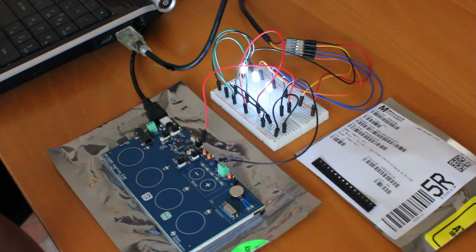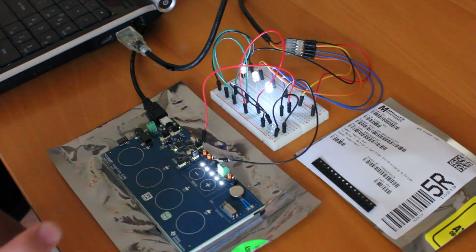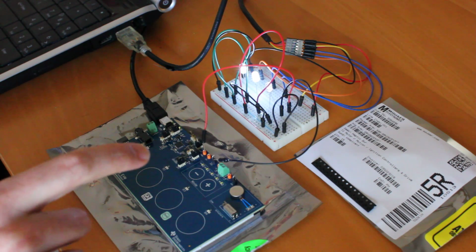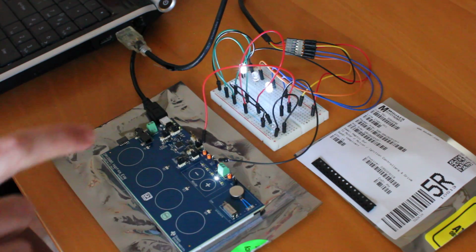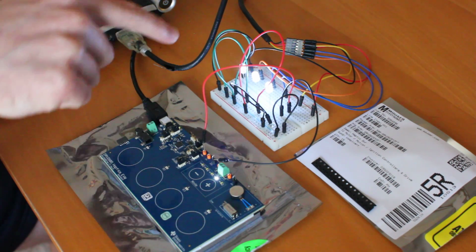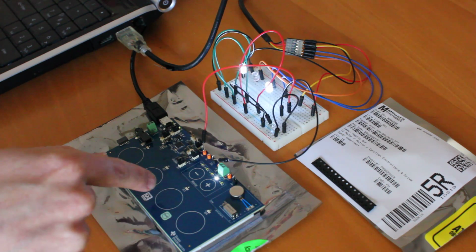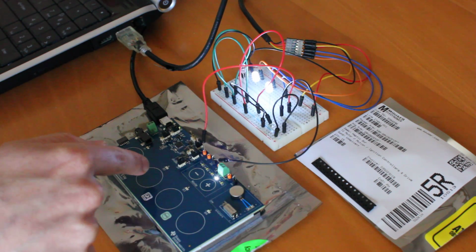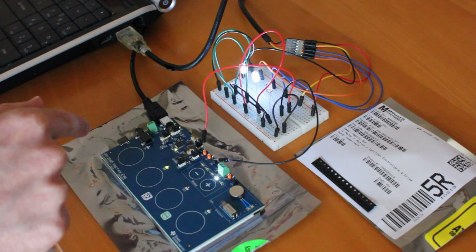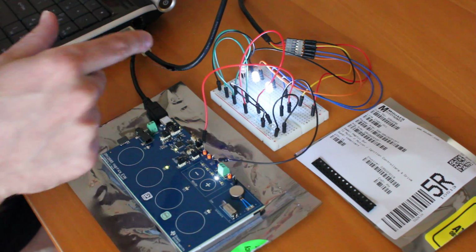And next what I'm going to do is put it into PWM external mode. With that, now what I'm about to do is turn on motor control through PWM. So whenever a light goes bright, it should spin up the motor faster. I'm going to do it on B2, which is the LRA motor, which is a little bit loud. But as you can see, it's kind of syncing with the lights.